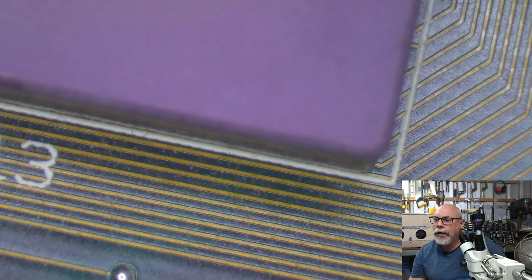Okay, what do we got here? Is Kapton tape enough insulation from a heat gun? It depends what you're doing with it. It can be enough for certain things, but for example, if you are pointing a heat gun at, say, a piece of plastic on the board, and you had taped some Kapton tape around that piece of plastic, it's not going to be enough. It's going to melt inside it. Kapton tape can assist with that. It can also be used to hold things in position, but Kapton tape is very thin. And although it is heat-resistant tape, heat can still get around it and get through it.